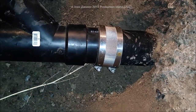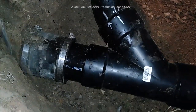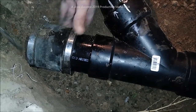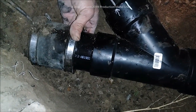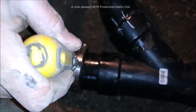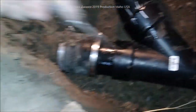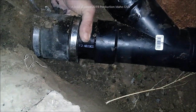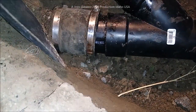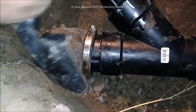I'll get my coupling on there. On this side we'll just be taking a large screwdriver and working it back onto the pipe because I'm up against the dirt here. It takes a little bit to work it on, but you need to make sure that you have cut three and a half inches to fit in here — your fit-up would be three inches, but you need a half inch from center to make it centered. So when cutting your short pieces to go in right there, cut them at three and a half so you can eyeball that half inch fairly easy.